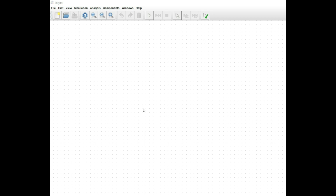Now, that brings me to page size. A lot of guys will do something along the area of 8 kilobyte page size, but really that's a bit overkill for a lot of people. It's very complex to program for. You have to keep track of a lot more stuff. So I've elected to aim for 16 kilobyte window size, which will give me 4 windows of 16 kilobytes for a total of 64 kilobytes. And within each window, we can bank in a page of either ROM or RAM.